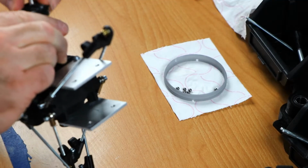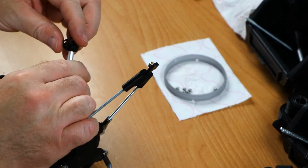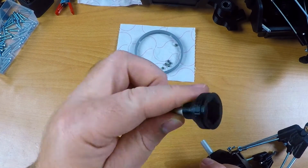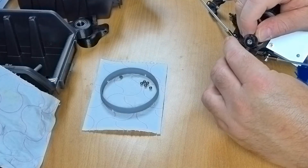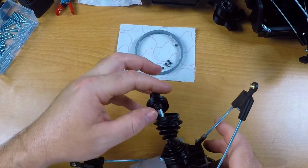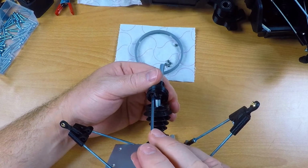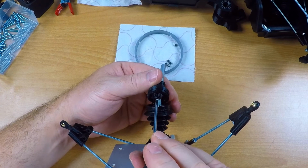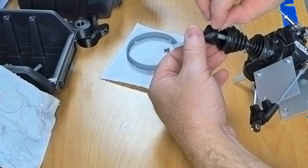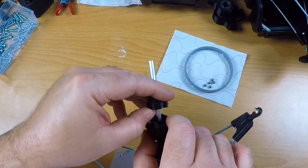This is going to be really awkward. Same goes for this side. On goes the ball cage. Here's the wheel drive shaft. That goes on next. Like so. And again I need to line up this ball groove with that ball groove and at the same time with one of those openings in the cage. The first ball is always the easiest. There it is. 60 degrees turn.